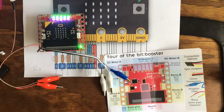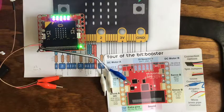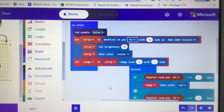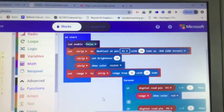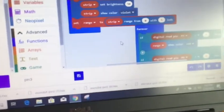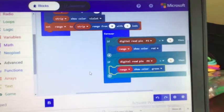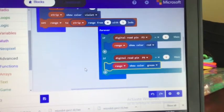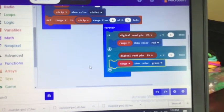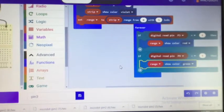Again, you have to disable the LED matrix to use those pins, and it's just a matter of connecting 3 volts — you don't want to use 5 volts or more. Here in the code, at the top you can see LED enable false, which tells it not to use those LEDs. The setup blocks after that configure the LED strip. Then the logic: if pin 3 equals 1, set that range of 5 LEDs red; if pin 9 equals 1, set it green. That's how to use external switches without having to use the A and B buttons.